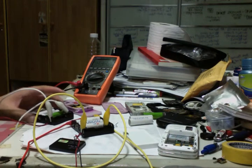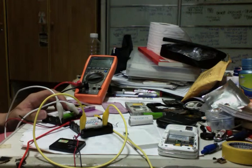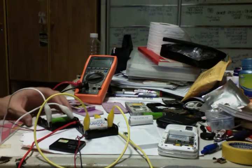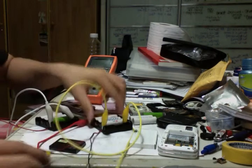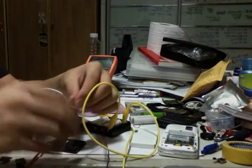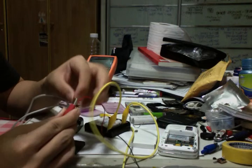Okay, 3.7 volts — this one is 3.7 and that one is also 3.7 volts. Hopefully it doesn't blow up in my face or connect both wrongly. It's supposed to be in parallel, so using what I've learned in secondary school and JC, it should go red to red to make parallel from the two batteries. I'm going to connect these through the red wire.